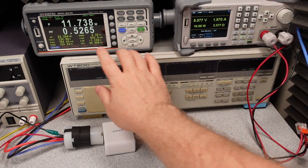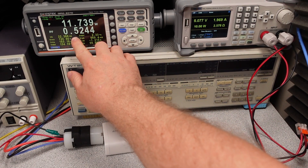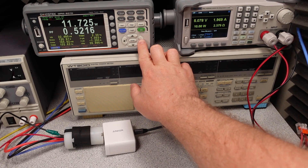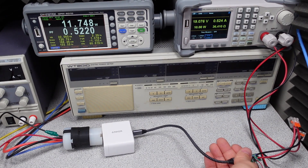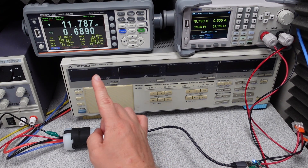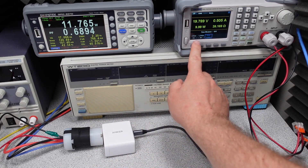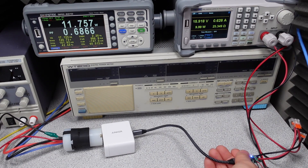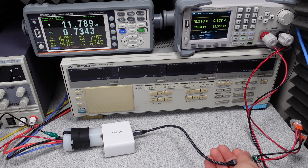At 10 watts and 5 volts out, the current spikes don't go away. We see the first downfall for this device — it is not competitive with the competition: no power factor correction in this mode. Power factor correction is a technique to consume AC power as efficiently as possible. The higher the power factor, the lower the comparable current, and therefore the lower the loss in the wires and transformers that supply your power. This device has fallen into the trap of newer power adapters of removing power factor correction, and in this case only in some modes of operation. When I switch through the voltage modes, we can see the power factor correction suddenly turns on when I get to the 20 volt mode — so this device has power factor correction, but only on the 20 volt output.